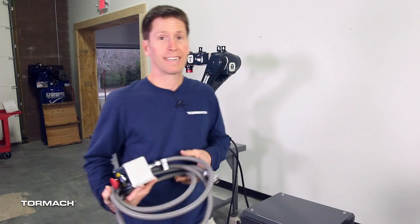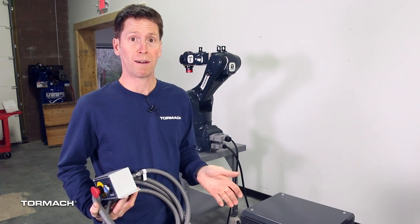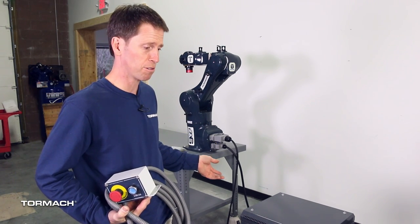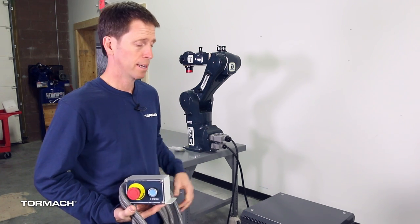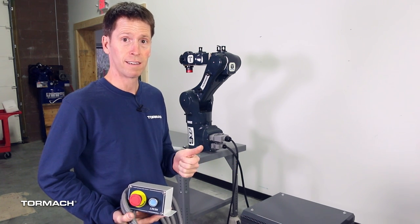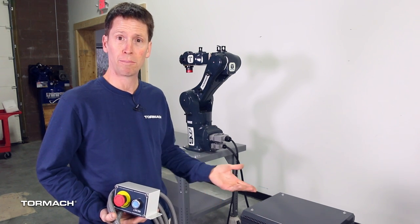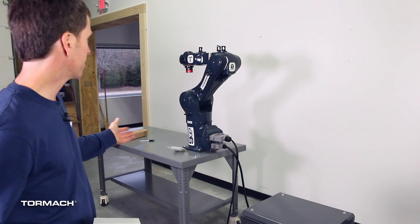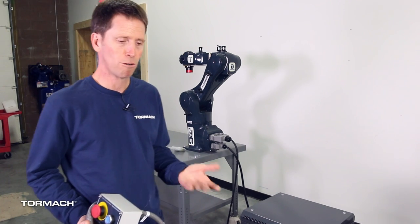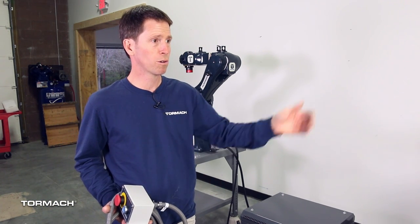As I mentioned at the beginning of the video, the safety of a robot installation is highly dependent on what you're going to use the robot for. We're using this robot just to demonstrate how to install a robot, so our safety procedure is going to be limited to plugging in an external e-stop so that the operator can remotely e-stop the robot from a safe distance away, and also configuring the one necessary safety input. In our case I just have a light curtain that we're going to plug in. Typically you're going to have a robot against a wall, up against a corner, caged on two or three sides, and you might use that light curtain for the fourth exposed side to prevent an operator from getting close to the robot without it going into a safe state.